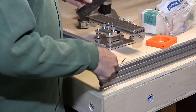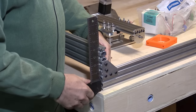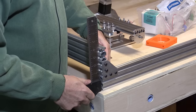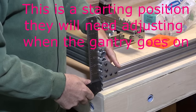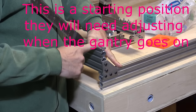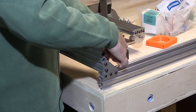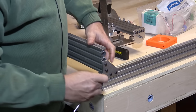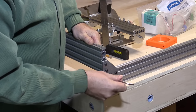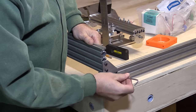One of the things I like to do is put my T-square on the end and just make sure I get this aluminum exactly on the edge, because I know these pieces are exactly the same length front and rear, and these Y rails are exactly the same length as well. So if I make them all exactly mating up together, it should automatically be square, short of any of the brackets being a little twisted — which I'm pretty sure they're not.